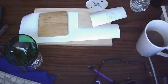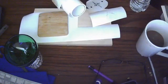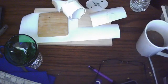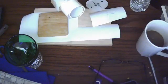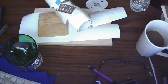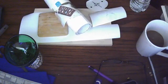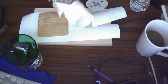Also, of course, you want your stencil. For the stencil today, I decided I'm going to use vinyl. Vinyl is really good. It's a thicker type of material. It adheres better to the surfaces that you're going to be etching on, whether that is electro etching or chemical etching, such as glass. You want to use something that will adhere very well to the subject being etched, because you do not want there to be any way that the liquid being used can seep under the design, because if that happens, then whatever design you're trying to put into the item is not going to turn out the way you want it to.